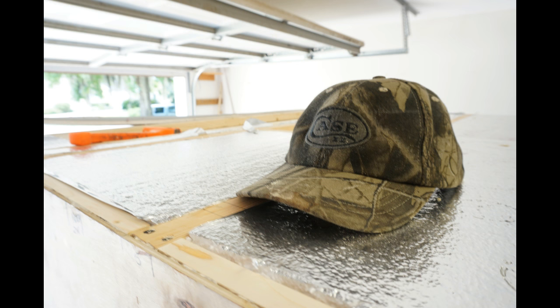After documenting measurements of all structural components and wiring inside the walls, the next step was putting the final top layer of insulation. Because of the roof thickness being an inch and a quarter, we used a three-quarter inch rigid foam insulation, then put a top layer of half-inch expanded polystyrene — the little white foamy bits — with foil backing on top. This gave us the right thickness.